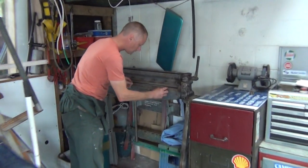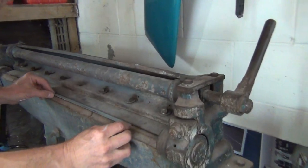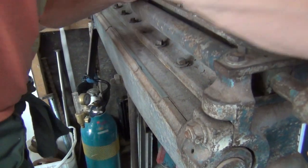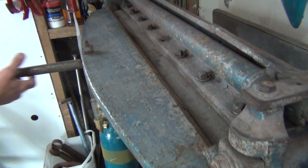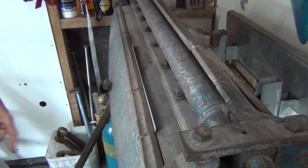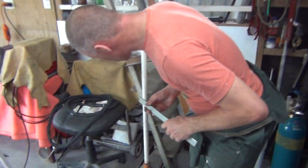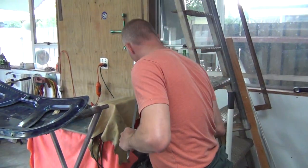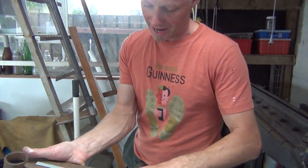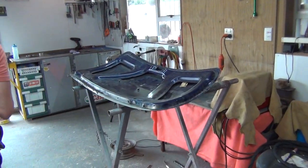In we go — I'm going to fold this on the 10 mil mark. Like Jamie Oliver still has to cut the carrots before he can make the main meal. So we'll squeeze that up, fold that right angle 10 mil, but I have all intentions of cutting that down to 5 mil — there's no way this will fold at 5 mil. You can also do this at home with your homemade folders and just hammer that over with your angle iron. You don't have to have a set of folders like me, it just makes life faster and easier.